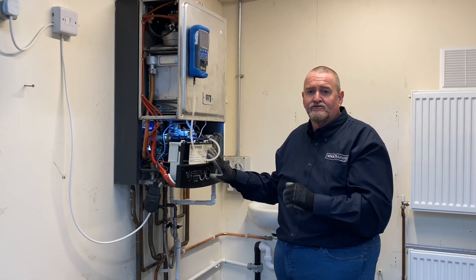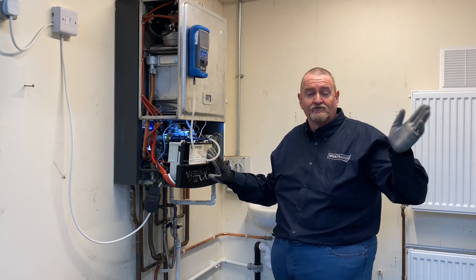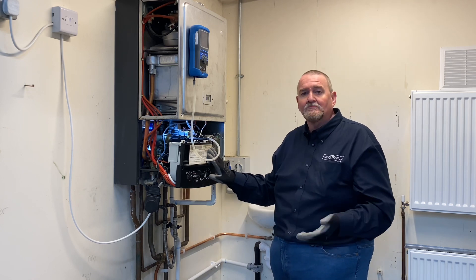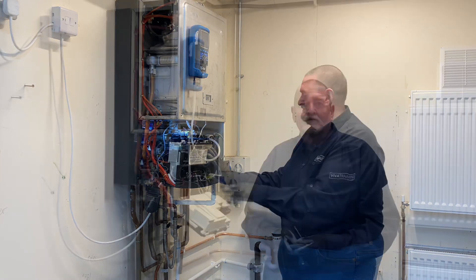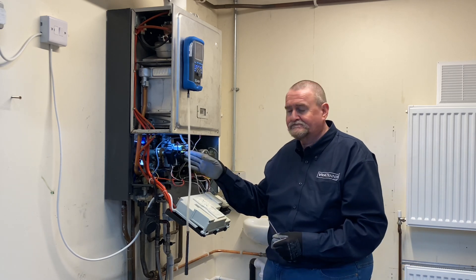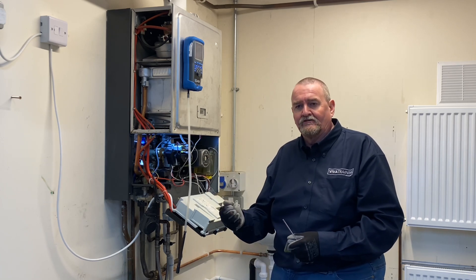That's within the tolerances that most manufacturers see. I would have checked at the meter if it was a little bit low, because it's only one millibar difference between the meter outlet and the inlet to my appliance. The next stage is moving on to doing the actual burner pressure - this is the inlet working pressure. We've now removed the hose and tightened the test point.